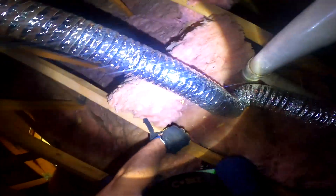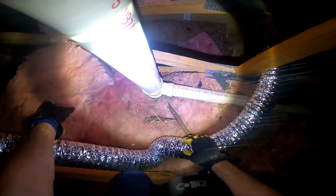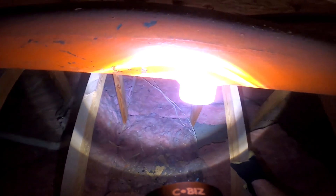Making our way back towards your master closet and skylight, I want you to look at the master bathroom duct — notice how it's kinked up. In a couple of the shots you can see it probably could run a little straighter to get that air flowing a little better for you.